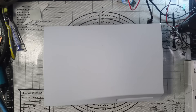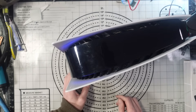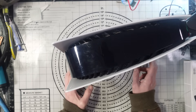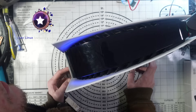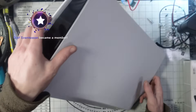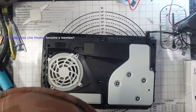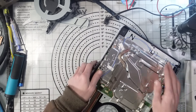Blue light of death — let's confirm that. This console has been dropped, and the disc drive is making a funny noise when first turned on. It's a 1200 series PS5; we've seen a few more of these come in lately. Let's connect up to UART.